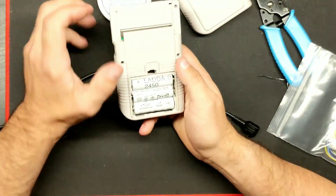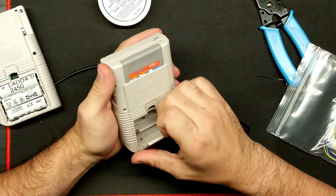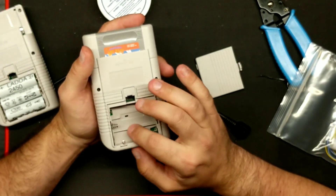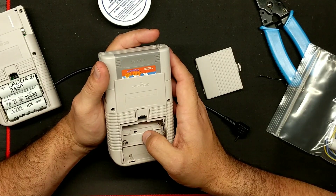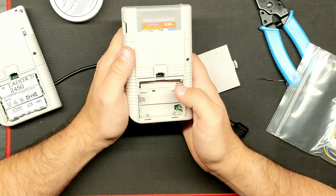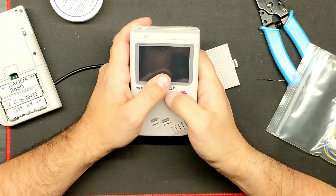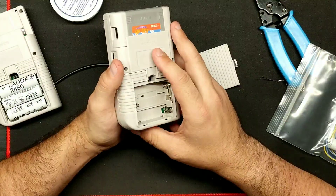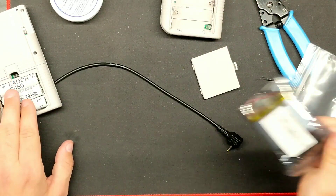What's nice about this is you don't have to cut up your battery door area — it remains the same. The other nice thing is you will never, ever have to remove those AA batteries unless something goes bad, like one not charging properly. You could always check them with a volt meter. You'll usually notice if something's wrong during gameplay — if you've only gotten an hour out of the batteries. These batteries are much, much safer than LiPo batteries, and that's one of the biggest things I wanted to move away from.